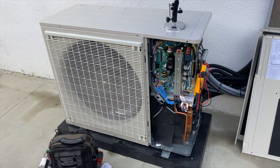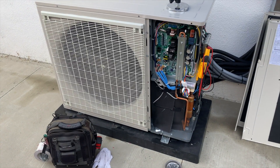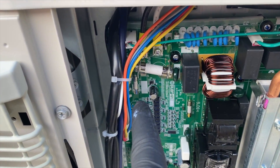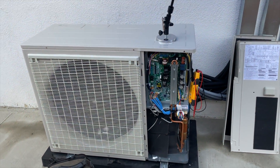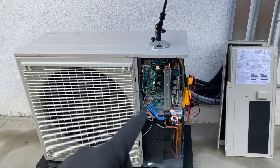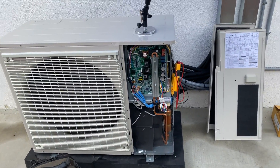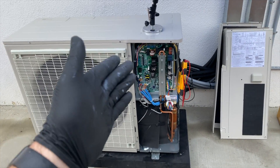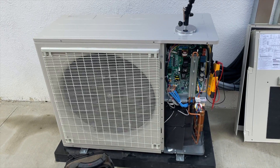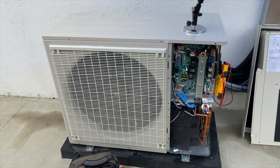All five heads are up and running and this thing is cooling. The whole problem was a dead short because somebody hooked up the condensate pumps wrong — which happens, and I'll be retraining those guys. The problem was that fuse. If you ever come across a Daikin 5MX mini split and you're not getting 240 volts going to the heads, check that fuse with continuity. If you have no continuity through the fuse, that's your problem. You can bypass it temporarily until you can get a board, since it always takes about a week to order. Thanks for watching — like, subscribe, hit the bell, and follow us on Instagram and Facebook.